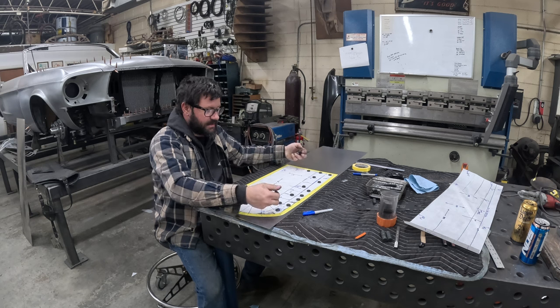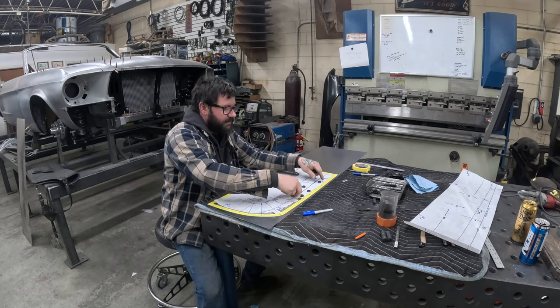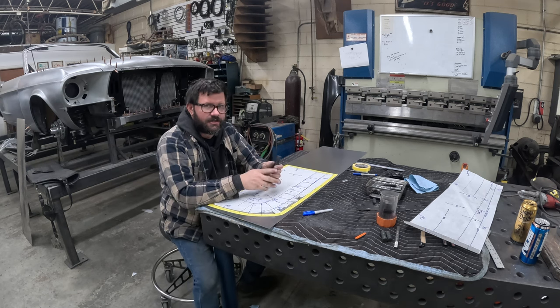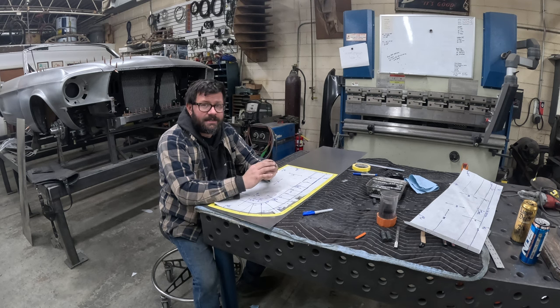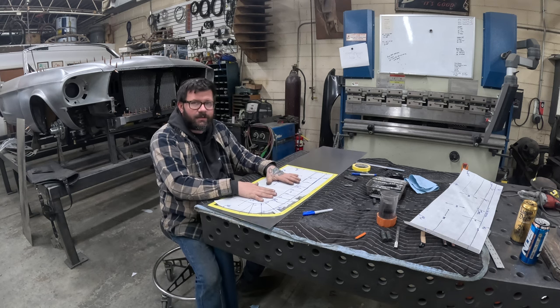the panel so you can see the little center punch marks. And they're nothing really to worry about in this instance because they were so light, it's just gonna mark it. And by the time we shape everything and blend it all out, they'll be so minor that you could run over it with 80 grit on a DA and you'll never even see the marks. So the only time you have to be really cautious of that is if you're dealing with aluminum, especially on aircraft parts, you can't be center punching the panels.